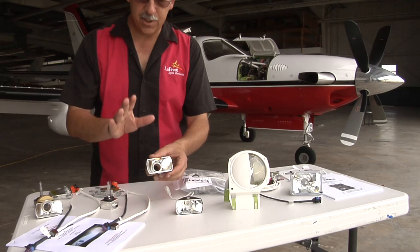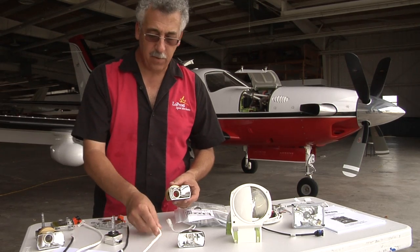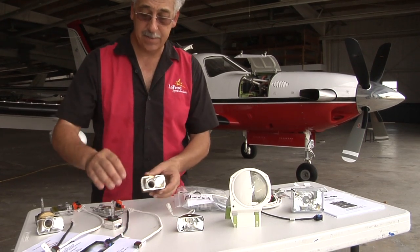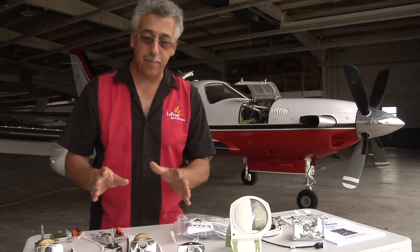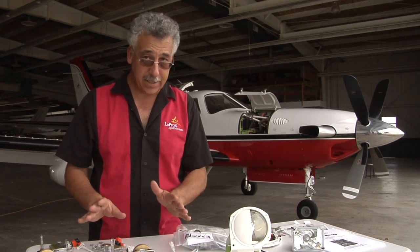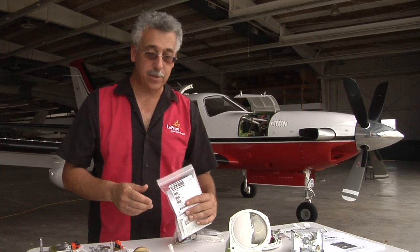The kit comes with very basic pieces: the reflector, the lamp, the supply wire for the high voltage, the power supply, and then the supply wire to the ballast. Each one of these kits comprises those same pieces for the left side, the right side, as well as the gear. Installing it is real easy — everything either screws or glues in place. We use these neat little fasteners from ClickBond to hold the ballast and wires in place.